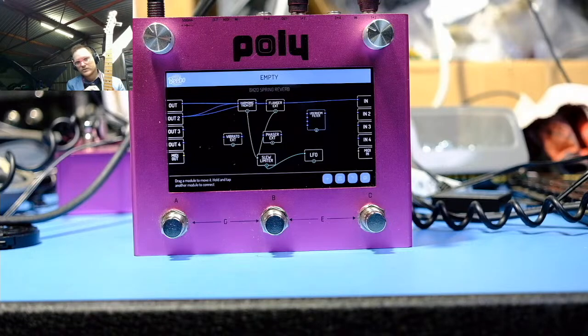Why am I running 24-bit converters that do 192kHz? Because it's hard to buy anything else nowadays. So I use the normal, modern converters, which are 24-bit. And to get to an actual 24-bit noise floor, you have to have really good circuit layout and design. So the actual numbers of the converters don't matter very much compared to the layout of the circuit board. And to actually achieve a proper 24-bit noise floor in a guitar environment is incredibly hard because of the impedance of the inputs and stuff like that for guitar. I don't find it easy to solve that kind of stuff. I don't think it is for anybody. So yeah, 24-bit though is the answer.